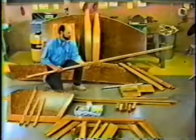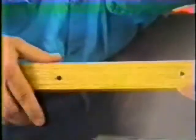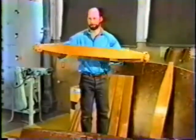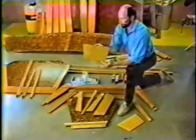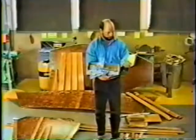Two of the ten-foot beveled oak pieces are the chines. They join the sides and the bottom of the boat. The four other ten-foot oak pieces get routed and become the handrails. These are the wedge and oar blocks. Four wedge blocks serve as spacers between the handrails front and back. The oar blocks mount between ribs one and two. The two skid boards attach to the sides of the boat. The anchor plates reinforce the large transom. Finally, the hardware kit contains all the fasteners you'll need to complete your ten-foot mini drifter.